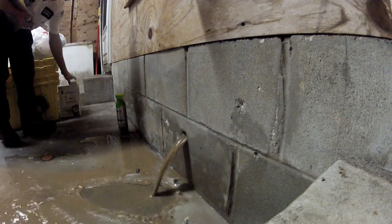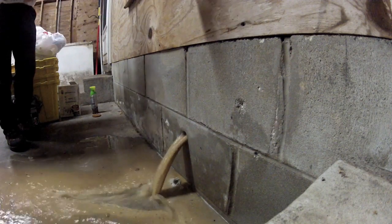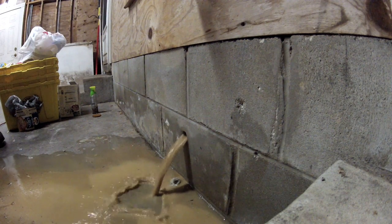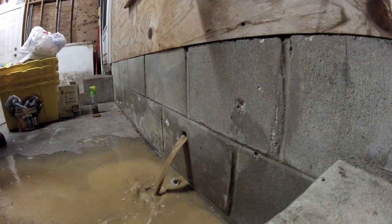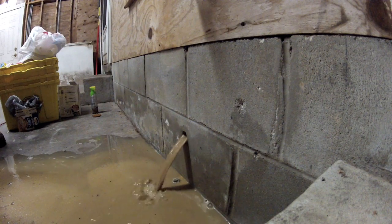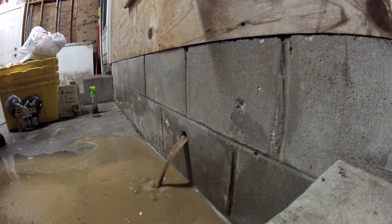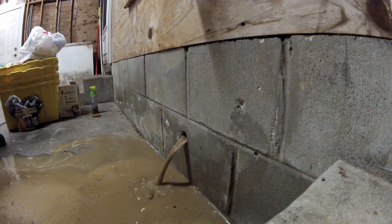Well, that's a pretty good sized leak. I have a feeling the fitting came undone. Every once in a while I get one of those, but almost always it cracks on the inside of a 90 or a T, where it comes together. It'll crack because it's been doing this constantly from temperature changes. Or it'll crack right at the glue joint, because the glue actually attacks the pipe. Man, that's nice.